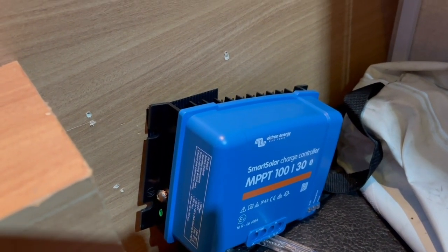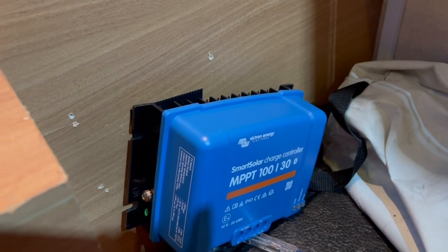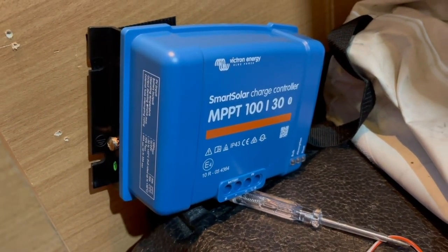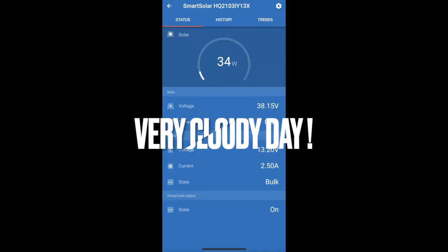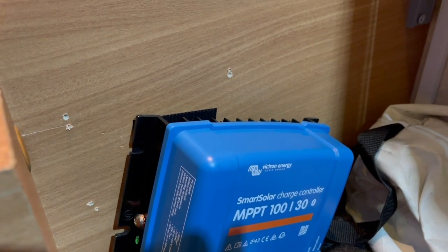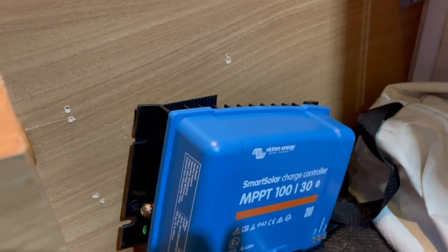It's roughly two weeks since I put the extra panel on and it hasn't made a big lot of difference, if I'm honest, because we've got a battery down. When we charged the leisure batteries back up on the charger, they went flat again within a few hours, so I think one battery is kaput and it's dragging the other one down. This Victron controller will allow us to charge lithium batteries too, with all the settings available on the app. Anyone with a Victron Smart Solar charge controller will know this app - you can alter all the battery settings. It's supposed to be up to 30% more efficient than PWM pulse-width modulation controllers, and it's certainly a lot bigger with a heat sink on the back.